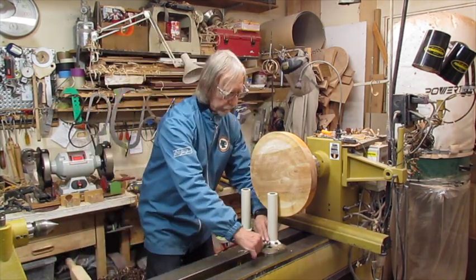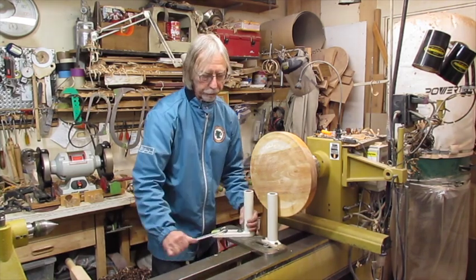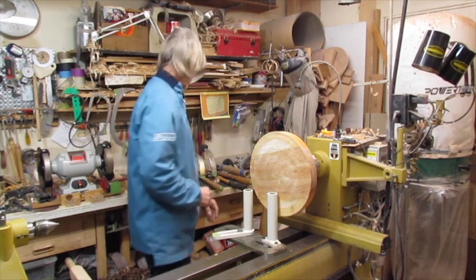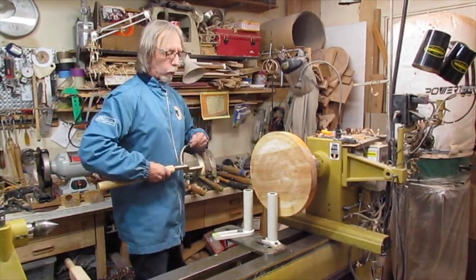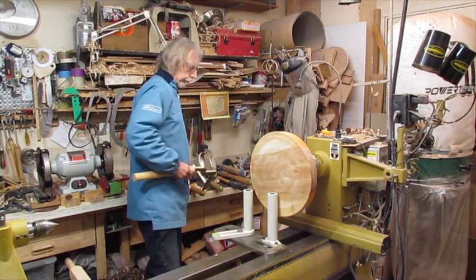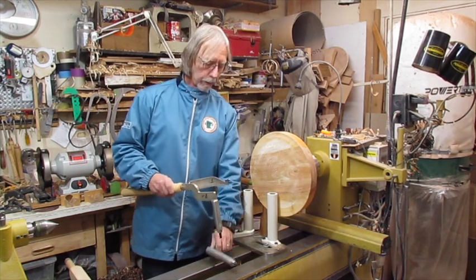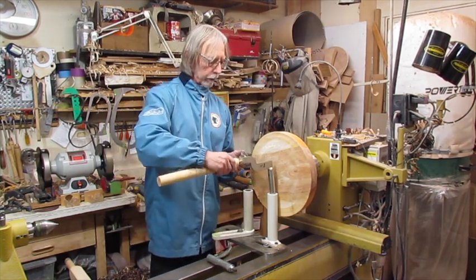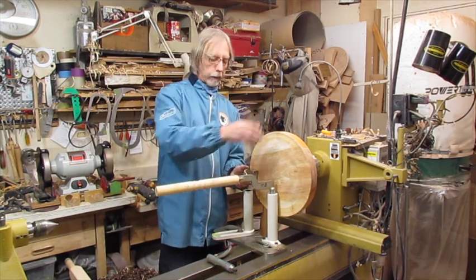So once we've positioned the base, our intention here is to do two cores. So we'll start out with the number one set of knives. And with this one-way system, you put it in here and you follow that around.